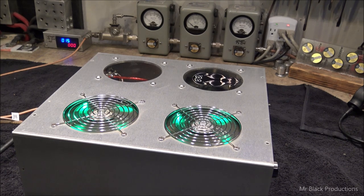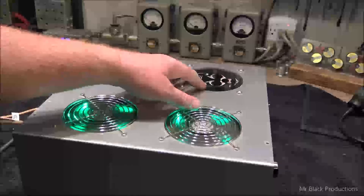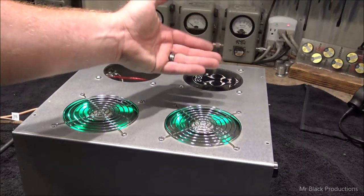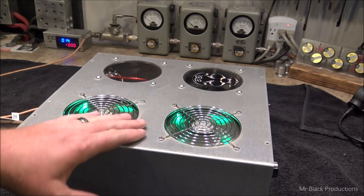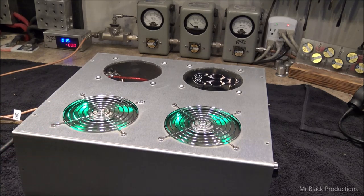and we do that for a reason. The transformer is very heavy. It might bend the amp or the transformer up, but I highly doubt it. With it being bolted to the plywood, it should be able to keep all the corners intact. We've just had a lot of problems with the transformers bending the very thin aluminum that our enclosures are made of. It's okay. I think we're going to be just fine. But two 120 millimeter fans, there's really not a scratch, dent, or ding on this thing, but we have radically changed the guts on the inside of this amplifier.